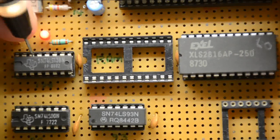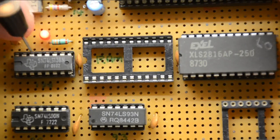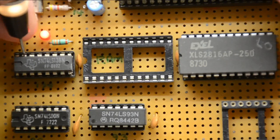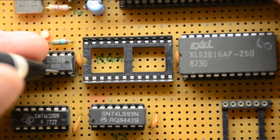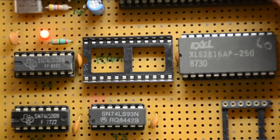That one is clocking — that's pin 14, and pin 14 is Q1 which is going to the display. So what we've proved so far is that there are two clocking signals: one going to the ROM and the other going to the display. If we go to pin 15, it's a high — and the high means the RAM is not being accessed. So the only two things being accessed at the moment are this one which is our display, and pin 7 at the bottom which is our ROM, showing the processor is running correctly.